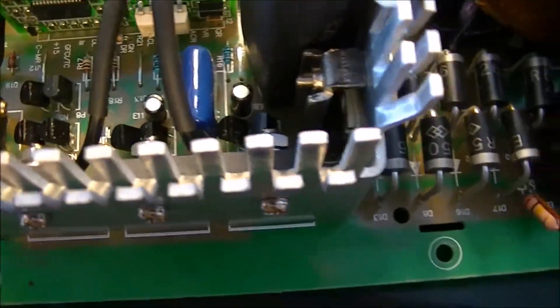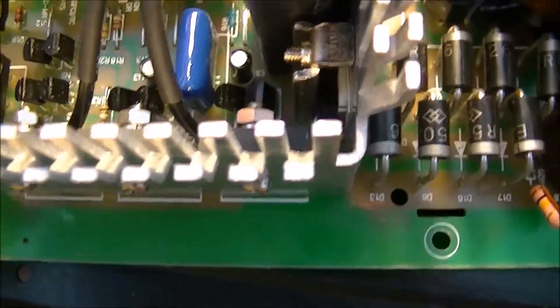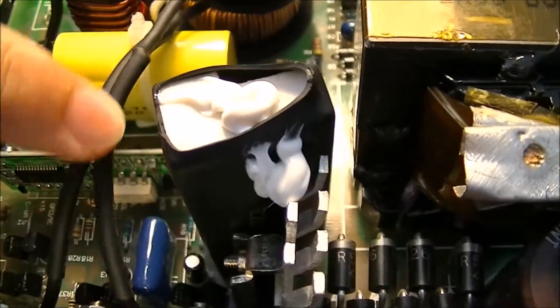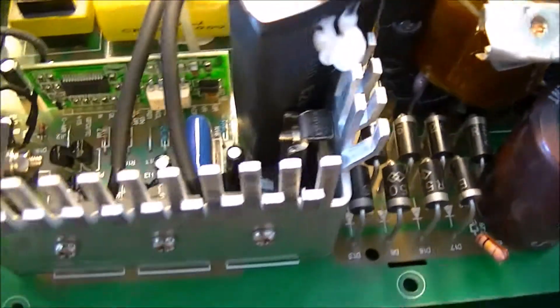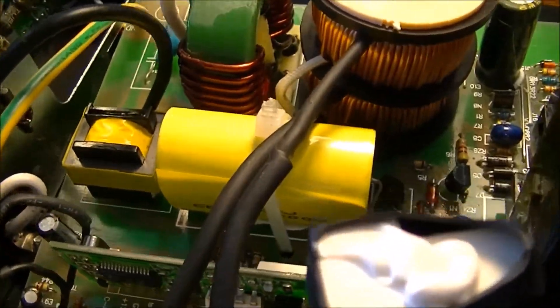This section is your output stage — all four of those big TO-247s. That's not on a great heatsink either. There are temperature sensors in here: one on the input stage, and others going over to the chokes. There seems to be some kind of filter here too. There's a small TO-220 package mounted on the heatsink — not sure what that's doing there. I checked and the control circuitry is all still working fine.